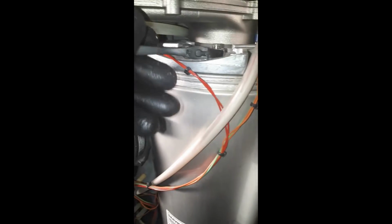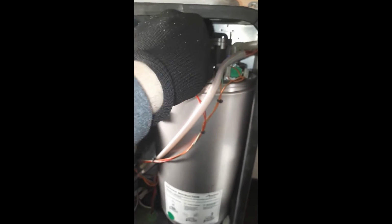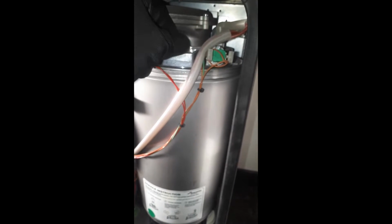On the gas valve, just above it, there's a clip and a black plastic nut. Pull out the clip, undo the nut, and pull the gas valve tube up. Then you want to undo the little nut on top of the heat cell. There's a little plate as well behind that. Keep them all safe. Then unplug the fan assembly